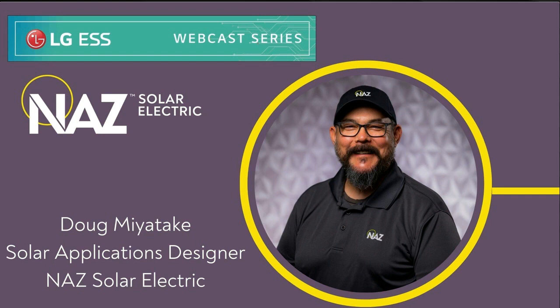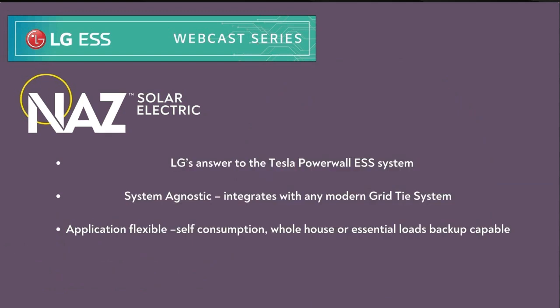Sandra was pretty thorough about all the basics. I'll just touch some of the highlights again to reiterate. This is what I would say is LG's solution to the Tesla Powerwall. I've had a lot of customers asking for Tesla Powerwalls. Of course, you have to go directly to Tesla for that. LG's got a great, and in my opinion a better, solution than the Tesla Powerwall. Good thing is it's system agnostic. Any modern grid tie solar system, you can integrate the LG Home 8 into that for battery backup.